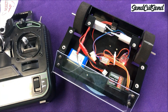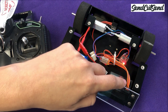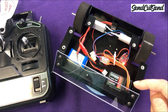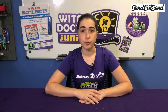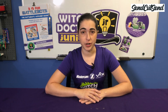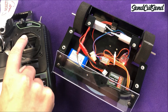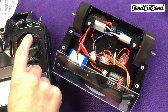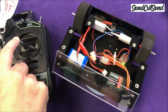If your wheels didn't move at all, make sure that your wires are securely connected to your motors and double check that you connected the PWM wires into your receiver in the correct orientation. The black or brown wire should be toward the outside of the receiver. Once both wheels move forward when you push the drive stick forward, we're ready to continue. Push back on the drive stick to see if both wheels move in reverse, then check the right and left direction. If any of these are wrong, check the wires on your drive motors or your receiver to fix it.